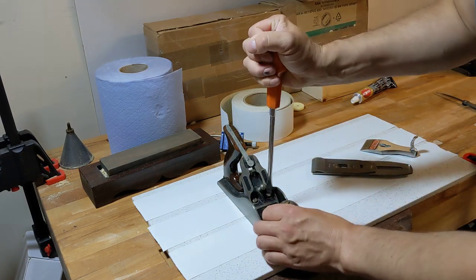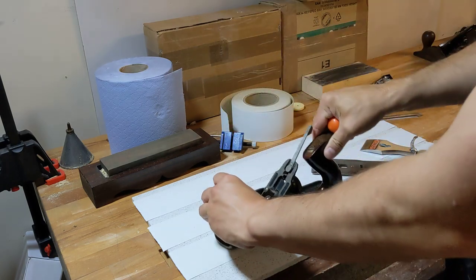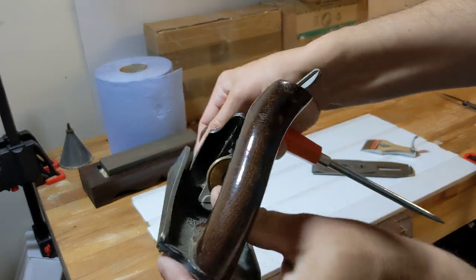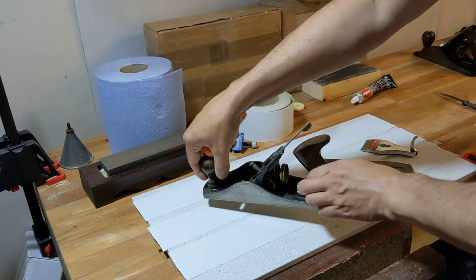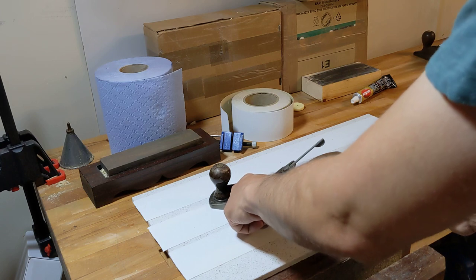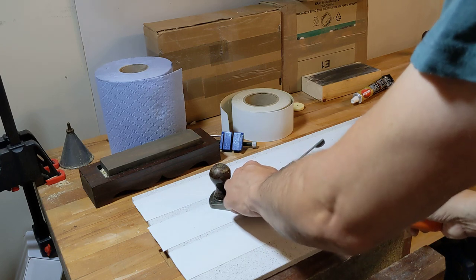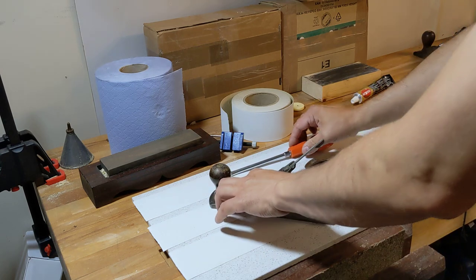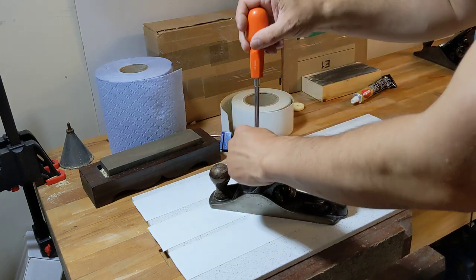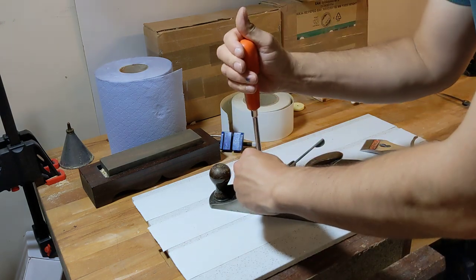And you've got a couple of screws in there. Just slacken those off. You don't have to take them all the way out. And there's a screw here in the back, the big one, just underneath the depth adjuster wheel, that one there. All we need to do is to gently wind that one back and use your fingers, because your fingers can sense so much. There's probably a little bit of play on things as well. Just get it nicely positioned. If there's a slight step there, don't worry. It's just more the case that once this is set, you won't need to do it.